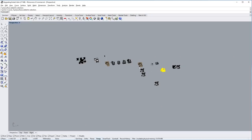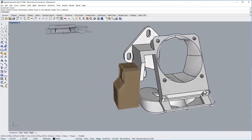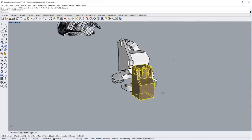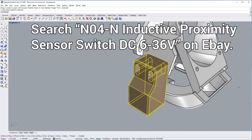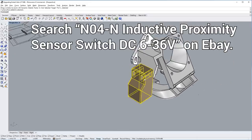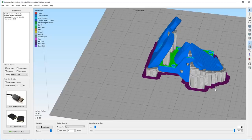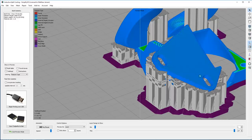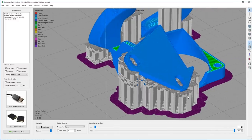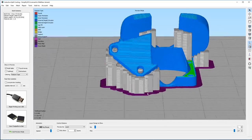This is my Rhino file where I made the fan shroud with the sensor mount, originally for the BL Touch. I've modified it to handle one of these inductive proximity probes from China — like $1.50 to $3 on eBay. Here's the geometry I drew up, and here it is in Simplify 3D. There's a lot of support material because this part has a cantilevered moment right down here that just has to be supported. There was no other way for me to design it, so this is how I did it.